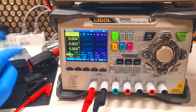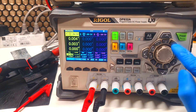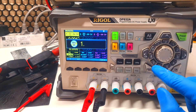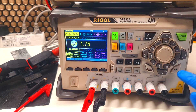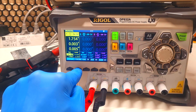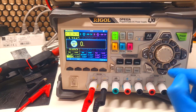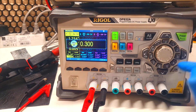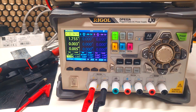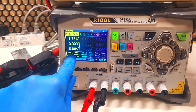I'm using a prototype zinc-air battery, so I will charge this cell with 1.75 volts. Then I press OK so the voltage is set. Now I will set the current — the current I will use will be 0.300 amps, which is 300 milliamps. Here you can see the voltage is set to 1.75 volts and the current is set to 0.3 amps.